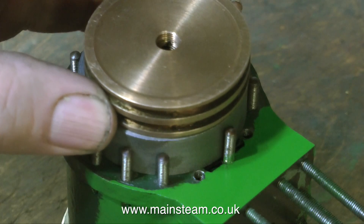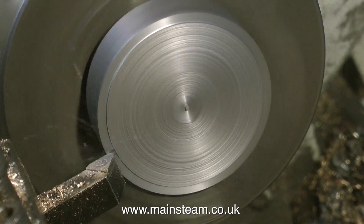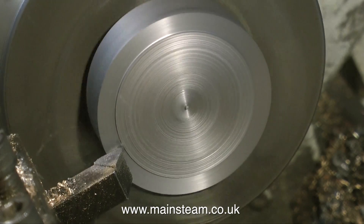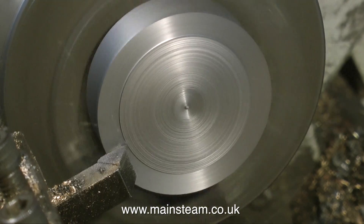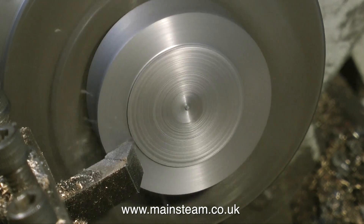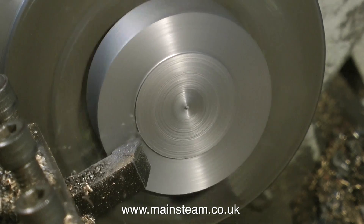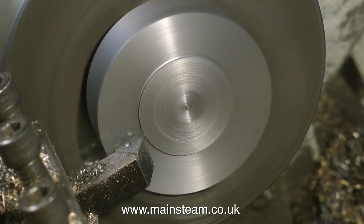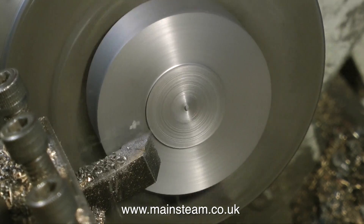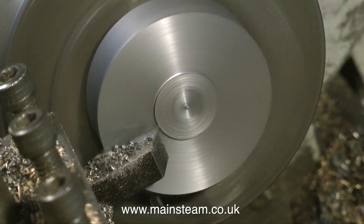What I need to do now is finish the machining on the smaller of my two lathes — my old Boxford. It's a great little lathe, very old, doesn't look very pretty, and I should really clear the swarf out of it more frequently, but it works well. The chuck is very accurate — it's a very old beaten-up looking chuck but appearances can be deceptive. The only bad thing is it does not have power traverse. I'm facing off the piston and I get quite a good finish straight from the tip of the tool.